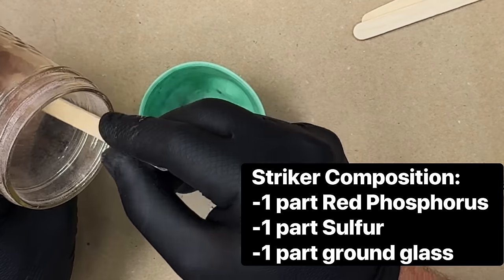So I'm going to mix them in a cup. Anytime you're mixing epoxies, this is a good legitimate tip. You want to switch containers at least once and switch stir sticks. When you switch containers, you want a flat bottom on your stir stick. You do not want a round bottom. So I am just squirting all this crap in here. All right, I'm going to transfer this over to this one.